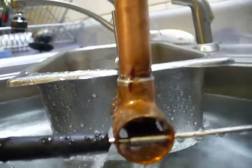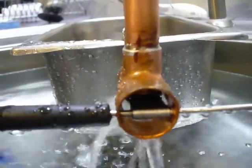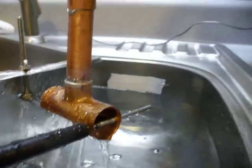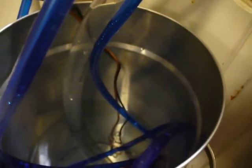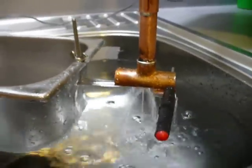And if you look inside, the arm is hinged at the tin and controls the small rubber float that plugs up the half-inch copper pipe. Right now I've got it set to simulate evaporation. I'm using a piece of tubing that's been siphoning out of the sink and into my canner, which is kind of a reservoir right now. I've got it going and rated about 20 gallons an hour for what we'll see on our 2x6 evaporator.